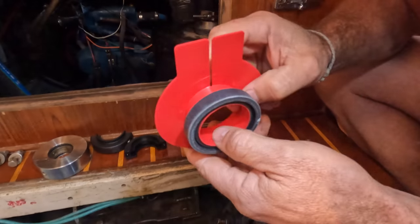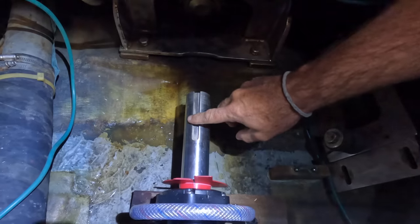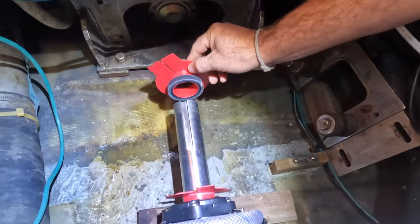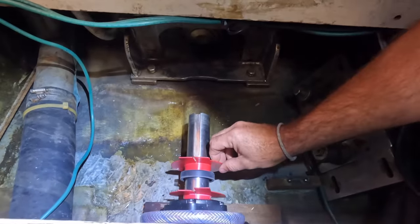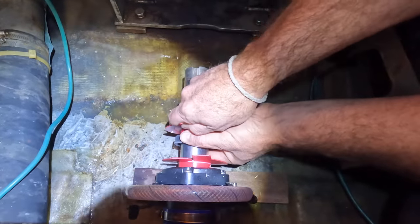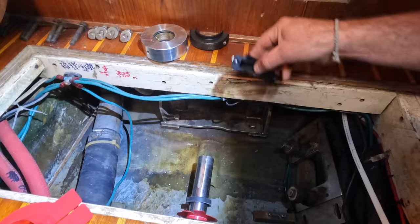The shaft's not too bad, so I'm not too worried, but if you've got keyways and sharp edges, you could damage your lip seal. You can see that when I slide this lip seal on, it actually slides along the plastic instead of the lip seal itself. I'll slide this down here for now and reposition everything later. Just slide that off there — that's your new seal ready to go.